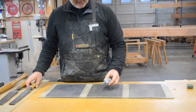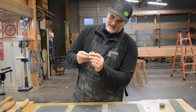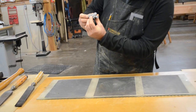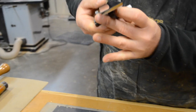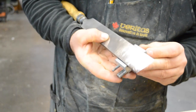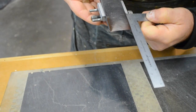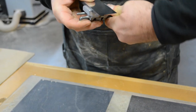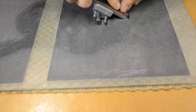There's a little guide on here that will explain the different degrees and the projection of the chisel and what degrees that will give you. The degree I like when dealing with Douglas fir is around 27 to 28 degrees. What that maps out to is an inch and a half off of this face. So I'll measure an inch and a half off here roughly to get there, then tighten this up. That gives me a projection and my exact angle that I want to achieve.